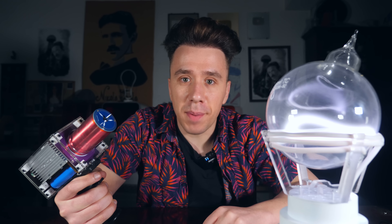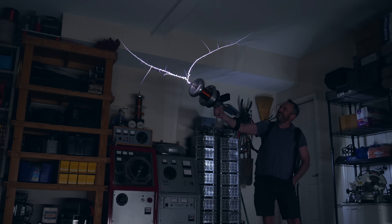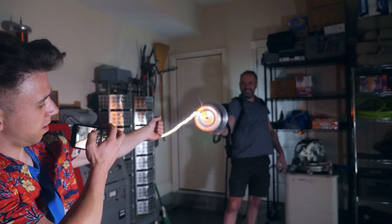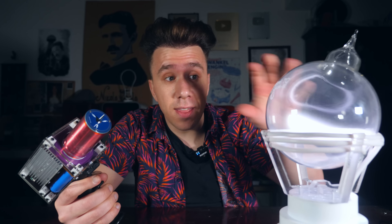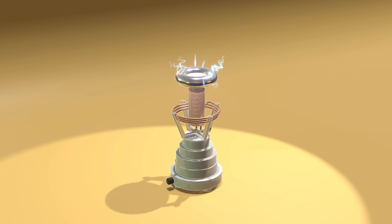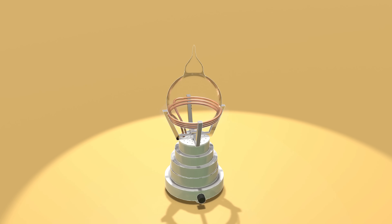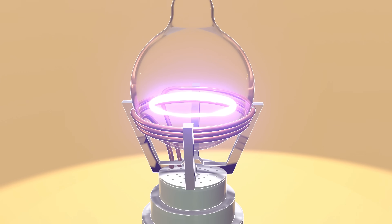Back to the video. This is the gun that Destin was talking about — it's basically a portable Tesla coil, useful to get this started sometimes. Cameron Prince, one of the people that reacted to this device, actually has a bigger version and he shot me with it. What this device is, is basically a Tesla coil without the secondary. Instead of the secondary, what you have is a glass bulb filled with low pressure gas in which a current is induced. This ring of plasma is that current.